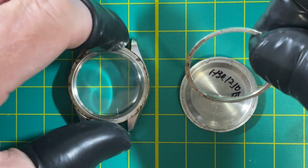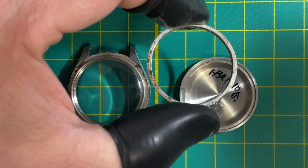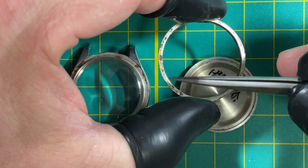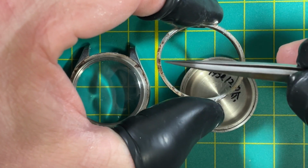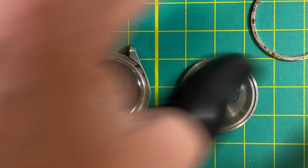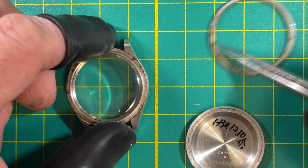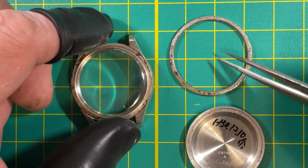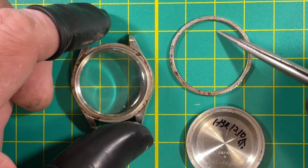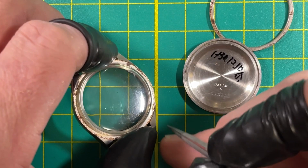So the way that works, hey, you got some corrosion on here. The usual thing. I use little teeny tiny things, almost like dental tools. You have to manually remove that. I mean, there are chemicals, like Evapo-Rust and stuff. People talk it up and it does okay, but I find that it just doesn't get into the really fine things. It's okay for a preliminary first step, but it's not what really does it.